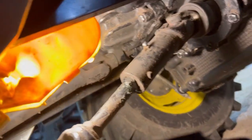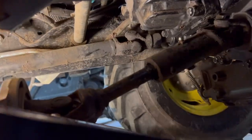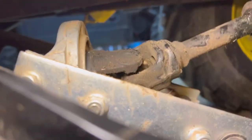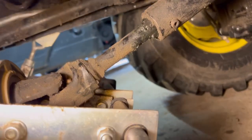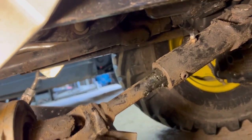Going off the last portion where I was explaining the two grease zerks on that drive shaft — there's one under that cover, take the cover off and you'll see it, and one right there. Keeping going with the grease section for maintaining your subcompact tractor: on these quick connects for the mower deck there are three zerks just on the shaft right here — one, two, and there's the third right there. Turn the shaft until they're easy to get to and grease roughly four or five pumps each. John Deere recommends every 50 hours.